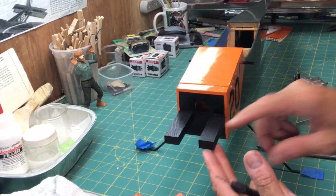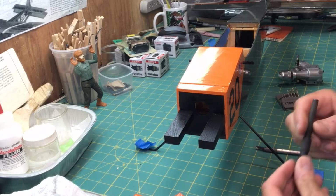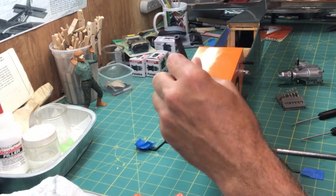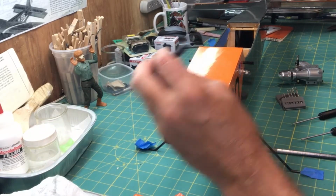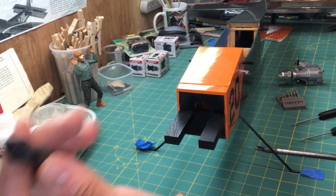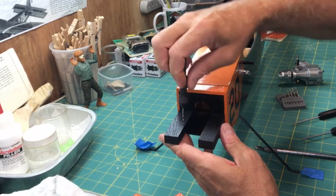Okay, so these mounting rails are a hardwood. I don't know what they are, if it's mahogany or what, but it's a hardwood. But I'm going to try to set some pilot holes. I'm going to try to drill these out with a smaller drill bit diameter, and that's going to be my pilot. And I'm going to try to do it, if I can, by hand.